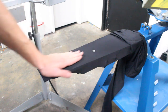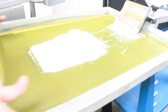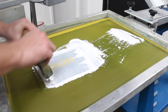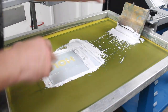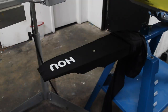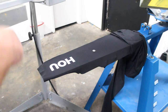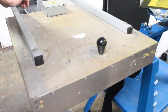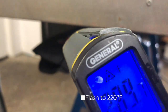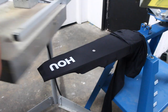And then with this little bit right here, I'm just going to pull it down and over. I want to make sure it's not in my registration gate so we don't end up chewing this up. We just want to make sure it's nice and adhered because we're going to flash print this. So I got my ink loaded up. I'm just going to flood it and hit it a couple two or three times just to make sure that we clear the screen. It's nice in line with the logo. Now I'm going to roll my flash over — I'm going to flash it because this is a low cure ink. We're using the Wilflex top score; it's going to flash in about five to six seconds.